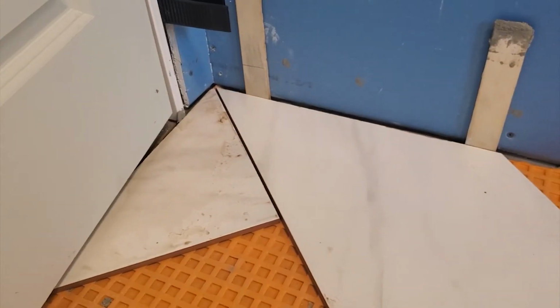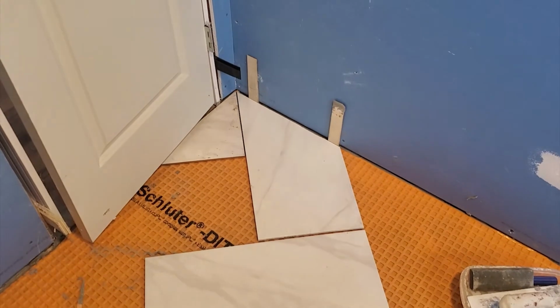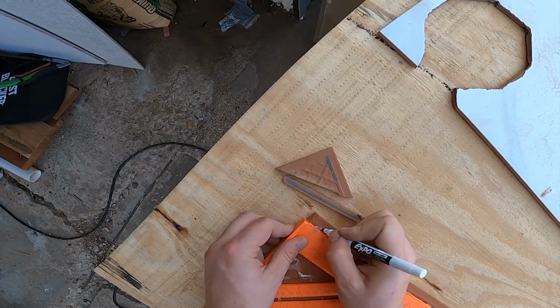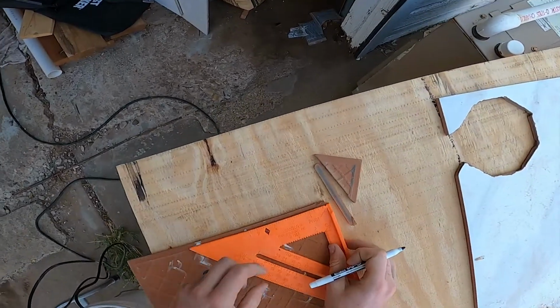We're coming back into this bedroom with a white marble looking tile. We're using 2x1 and we're going to do it in a herringbone pattern. Whenever you're laying out the pattern for a floor, you want to do it from the vantage point of when you will be entering the room.